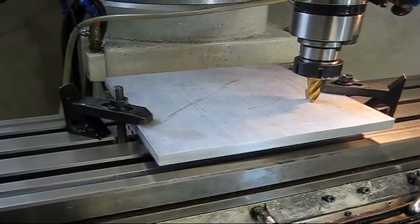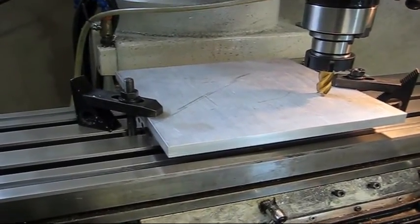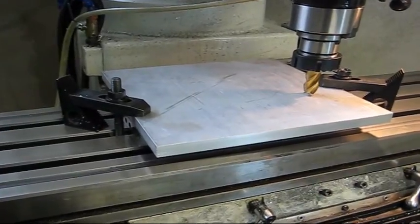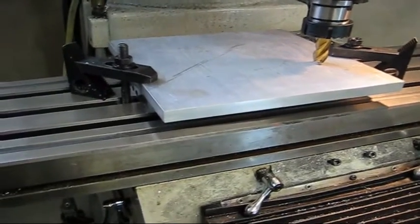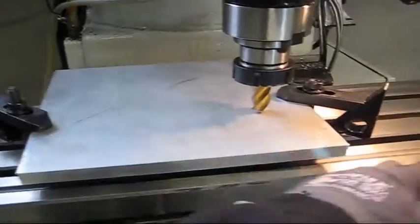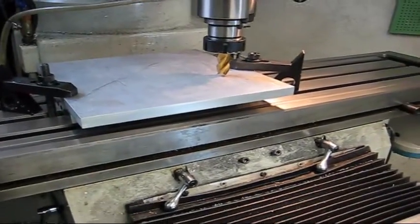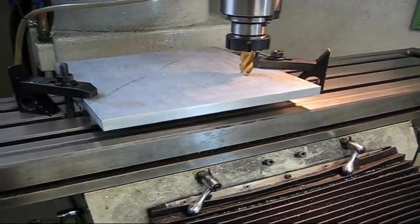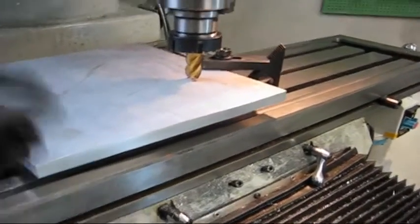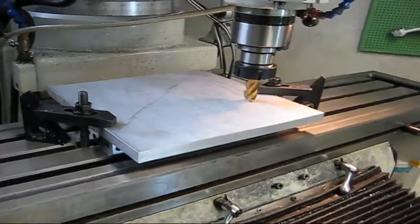After I got the first plate set up in the vise, I figured I'd have to hand feed the whole thing. So I changed my mind and put it on some blocks — we can power feed both ways, and we have about 10mm to spare so we can take both sides without moving it, and we'll use the whole table travel on the mill.